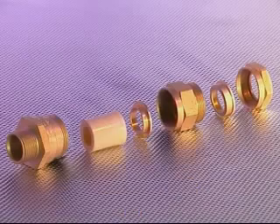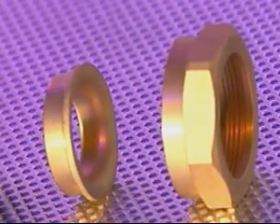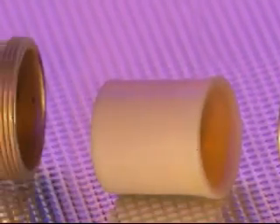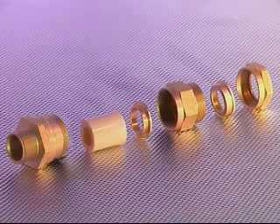The ICG 623 comprises six major components, these are the back nut, rear compression spigot, middle nut incorporating seal, compound spigot, compound pot and entry component. This type of gland is specifically designed for use with non-armoured elastomer and plastic insulated cables.